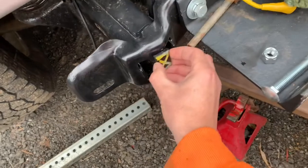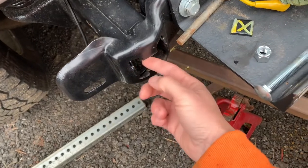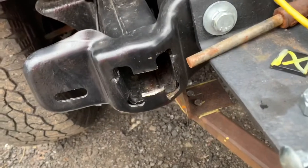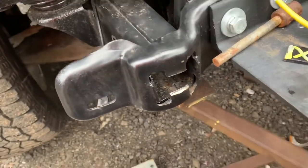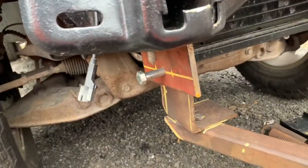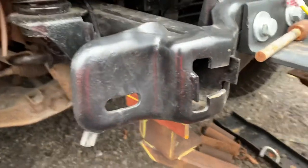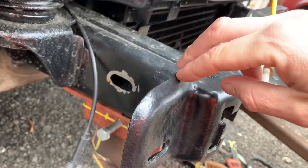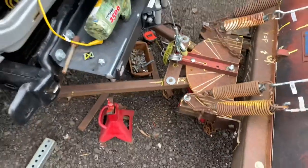There was a vertical section right there — it was open on the sides but I opened it up in the middle here so it looks like an H. That allows me to put a nut or bolt in there for these drop brackets. I'll put some drop brackets on the frame here — that should be better aside from going through this hole like I was previously. That's a little bit too close to the radiator, and dropping it down also gives me a more straight approach here, which is good.